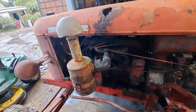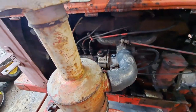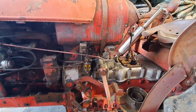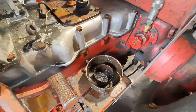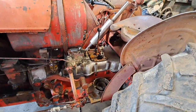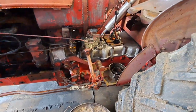Yeah, cleaner all needs stripping out. Fuel pump will be the same. Have a good look in there. Make sure it's not clogged up. The diaphragm in the back. Fuel, I did drop what water was in the fuel tank out. There's still fuel in there, so we'll just play that by ear. There's the bottom off the air cleaner that was completely chock, absolutely filled with silt. So, I might start getting some bits and pieces off and see where we get to from there.